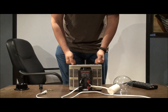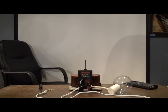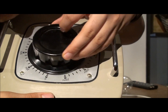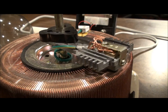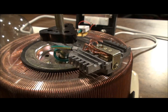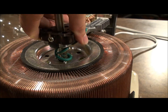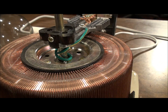Now we can actually lift the case right off. As you can see in a closer view, there is this brush that spins on this copper winding. This is just one copper winding, and you'd think a transformer normally has a primary and a secondary winding. Well, since this is an auto transformer, what an auto transformer is is a transformer where the primary and the secondary winding are basically just one winding. So you don't have two — you just have one.